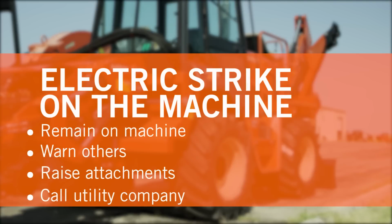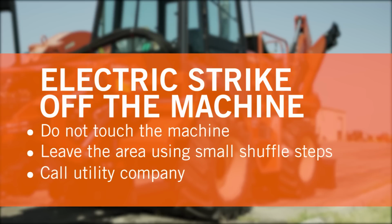In the event of an electric strike and you are on the machine, remain on the machine and warn others of an electric strike and instruct them to leave the area. Raise attachments and drive from the immediate area. Contact the utility company and do not return until given permission by the utility company. If you are off the machine, do not touch the machine. Leave the area using small shuffle steps and contact the utility company. Do not return until given permission by the utility company.